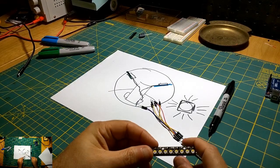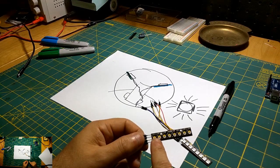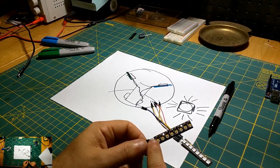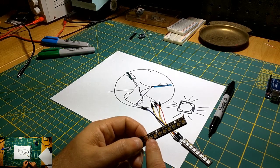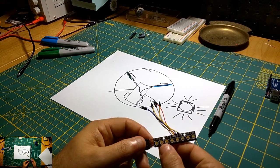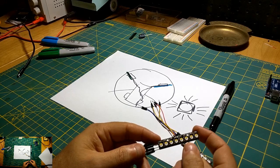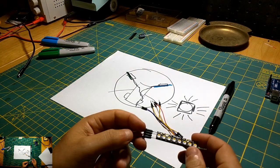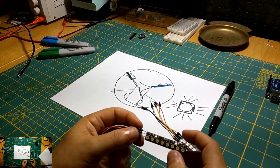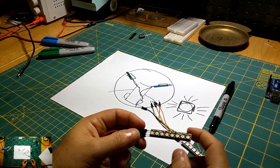And so Adafruit makes these, they're called NeoPixel RGBWs, right? They have the RGB chip right here, you can see in the clear space, but it also has a dedicated white driver as well. So what I found is that when I wanted to do a strobe, I could light up the RGB full white and this white SMD full white, and it was significantly brighter. I mean, it was extremely bright. I tested at 5 volts, and I think it was pulling 3 amps when fully on. I mean, these things were blindingly bright, which is good, right?